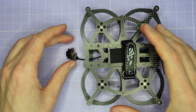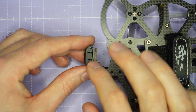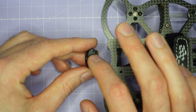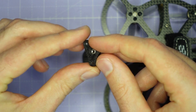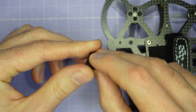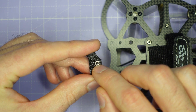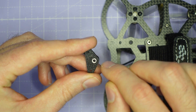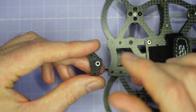The first thing we're going to do is install the plastic adapter that DJI provides for the O4 camera. Once we've installed that adapter onto the O4 camera, we again have those two M2 holes 16 millimeters apart. Then take the little camera adapter plates for the O4 standard camera — similar to the O4 Pro adapter plates, you have the option to install a little M2 nut into this little socket here. That's to allow you to screw in an M2 screw to lock the up tilt really securely so it's never going to move, but it's optional.